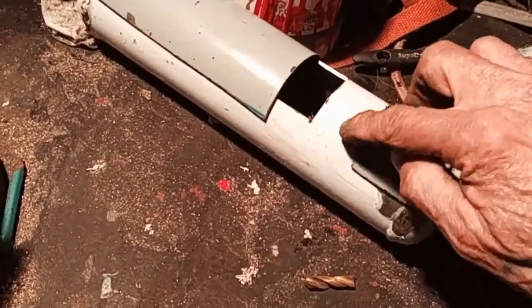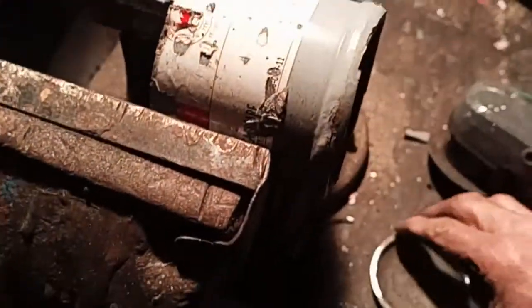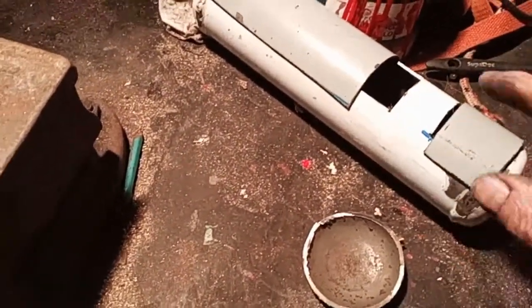Now in between we need a burner tray. So I've got the donor bottle - thank you, donor - and I've cut the bottom off of it. Now I've just got to make that. When it cools down, you're going to feel the heat coming off that. And that now has got to be sorted and welded in there. But first I've got to grind it and get it so it'll go in, turn around, and sit there.